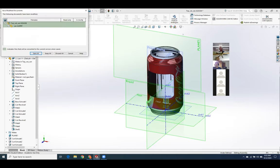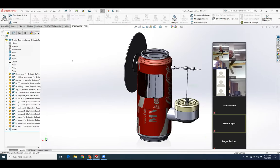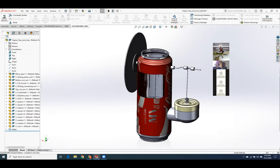And then that will actually be brought into the top level of this engine. So that way you guys will have a way to keep track of a part number as it goes through the manufacturing process, going from rough casting to finished part and then into the installation. If you do it this way, then everything gets purchased and you don't have to worry about something getting left behind.